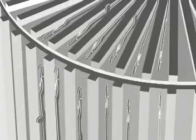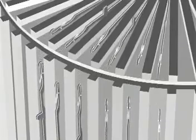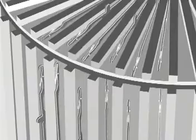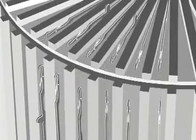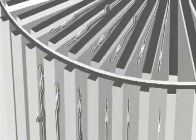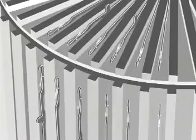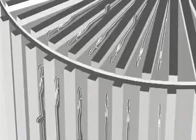This is achieved by the alternating needles in the dial and the cylinder never being activated at the same time. This requires 2 cam tracks for both needle beds. Therefore, the location of the butts on the needle shank must be in 2 positions. Most commonly used are butts in short and long configurations, as seen in this illustration. Needles with long and short butts are alternately arranged in the cylinder and also in the dial.